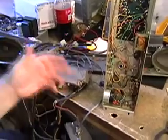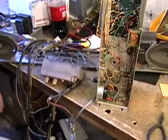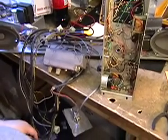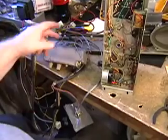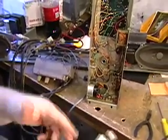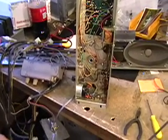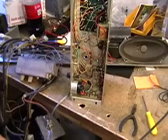And in some cases, you'll find there's a slight hum in the background that disappears when you switch to the LED. And that's because the AC ran up around the mechanism in the front there. It's near the volume control pots. And in some cases, it picked up a little noise from the neon bulb itself.